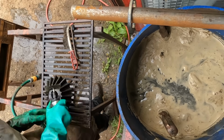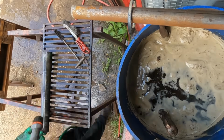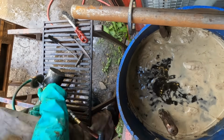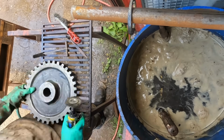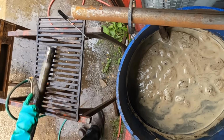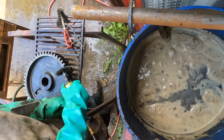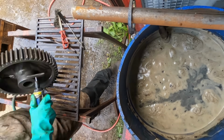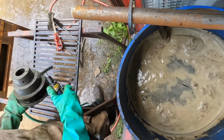The mixture had developed a lot of surface gunge, which needed to be scraped off the top before removing the parts for inspection. All of the parts received a rinse with water and a clean with a wire brush. The reaction leaves a black residue on the surface of the parts, and once this forms it actually creates a barrier stopping the mixture from working on rust that may be lying deeper on the part. It's essential that this residue is mechanically removed so the mixture can attack fresh rust underneath it.